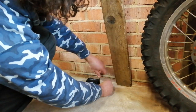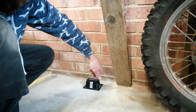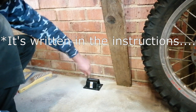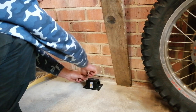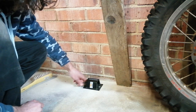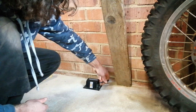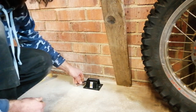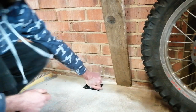You use the allen key that's supplied. The kit doesn't give you the drill bit or drill, but obviously they can't be expected to do that or the kit would cost a lot more. There's probably a specific torque you're supposed to do these up to, but from my experience doing things in walls, you want them up tight but be careful - this concrete is probably three or four inches deep. You can hear a cracking noise which is where it's grabbing the concrete.